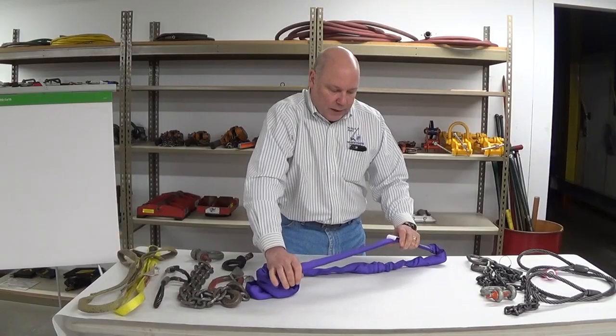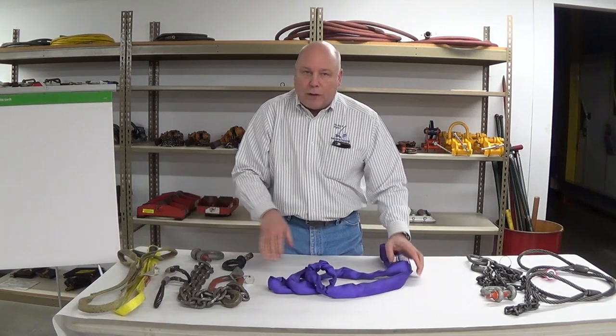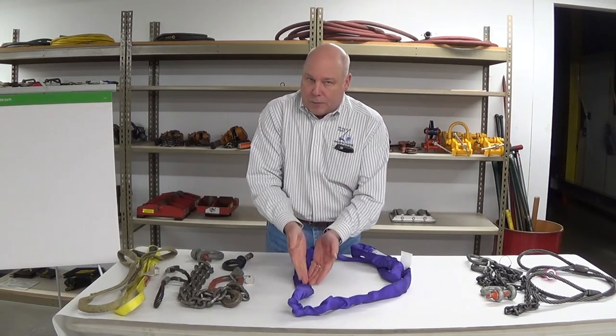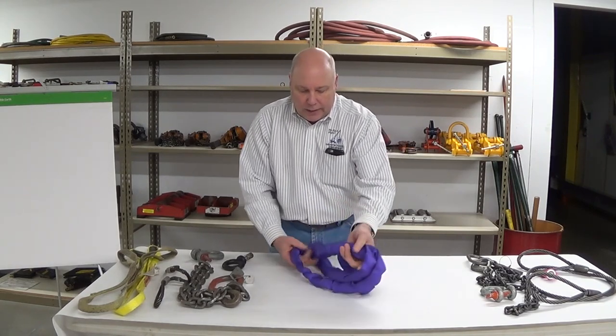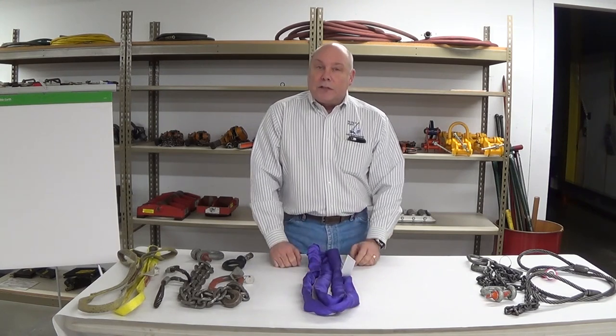One thing to note is that UV damage on a round sling isn't as significant as it is on a flat web sling. We're still looking for cut or broken fibers inside, cut cover with exposed fibers, illegible markings, chemical damage, heat damage, and anything that might take strength away from the sling. Sometimes slings get used hard, get bound up, and almost crackle as you open them — that's a sign we may have heat damage inside, and that sling needs to be removed from service.